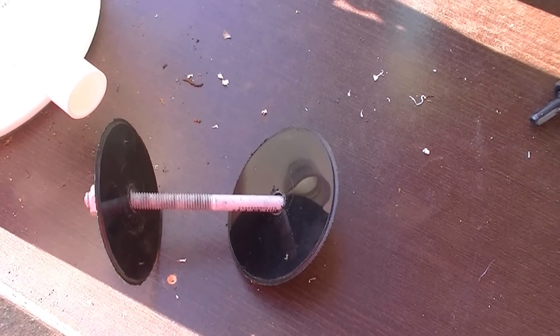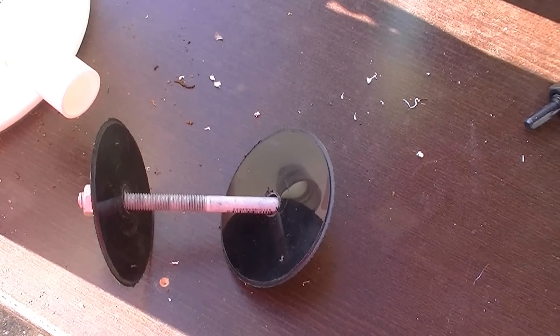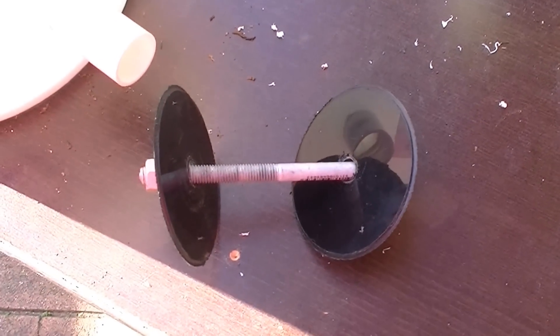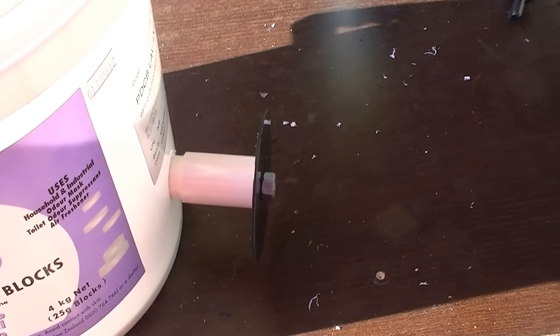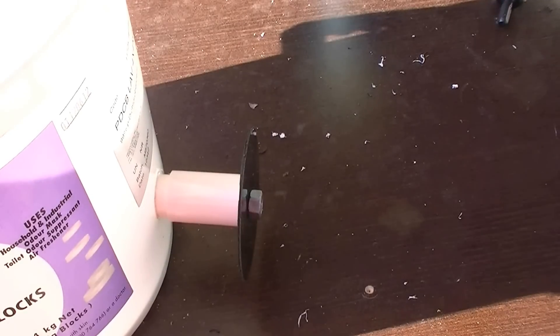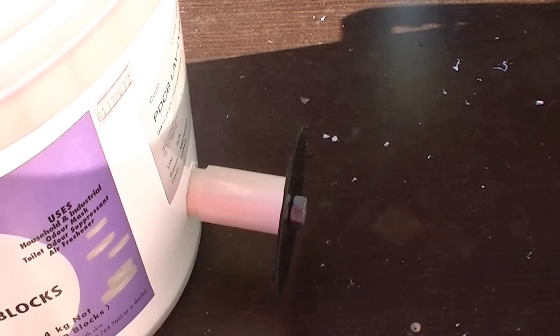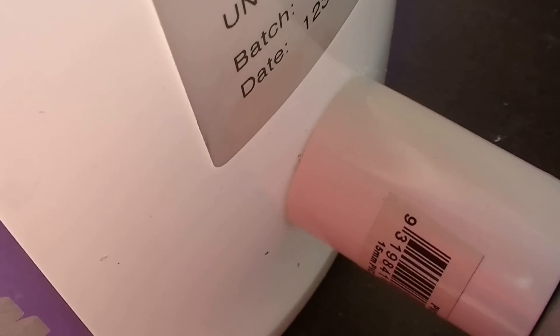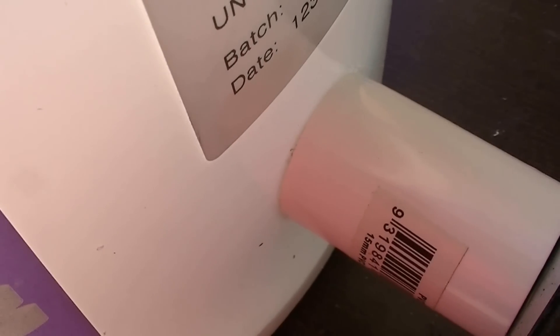I'll put the camera down while I fit this into the tap. What I've done is run a bolt through the middle of the pipe with a large washer on either end. I'm going to tighten that bolt up, which will squeeze the fitting so that the face comes up flush with the bucket — that's what seals the silicone. Once tightened, you can see there's no room left; it's snugged right up against it, squeezing out the silicone bead to provide the seal.